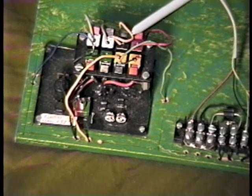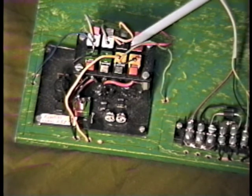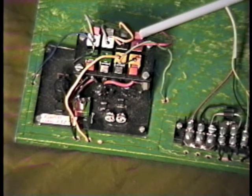The unit will actually operate on AC or DC. I operate it on the same 16-volt AC that I use for the magnetic type blocks. The only catch to this unit is you need to use a separate AC power unit from your track power. If you hook this thing up to your track power transformer, you tend to get a short due to the way this thing is grounded. So it's best — in fact they say almost necessary — to hook this thing to a separate source of AC power, a separate pack other than the pack you're using for your track power.